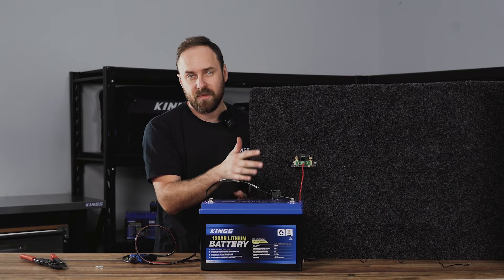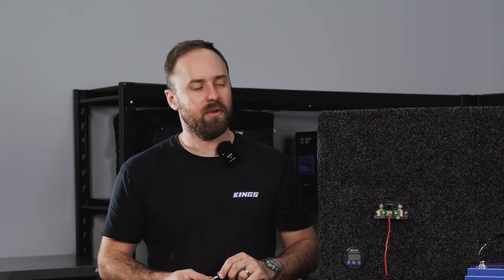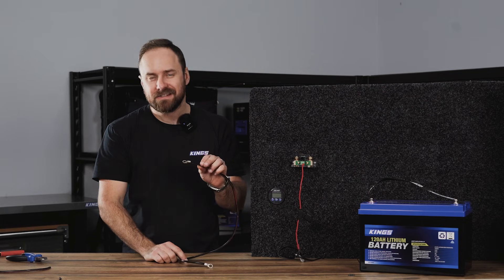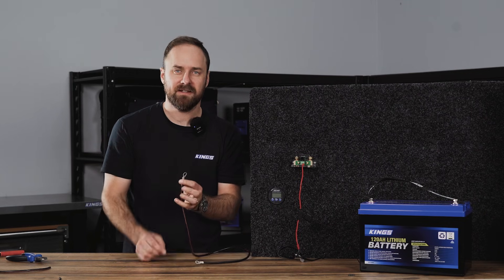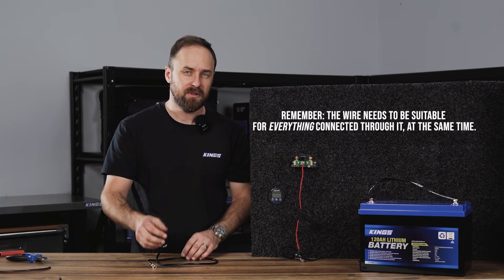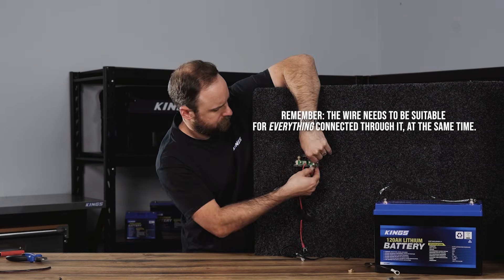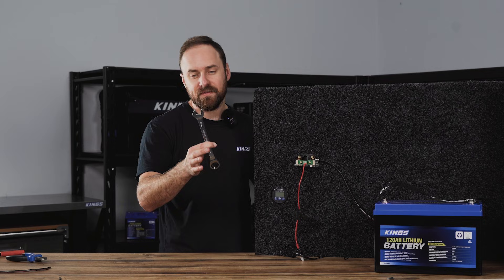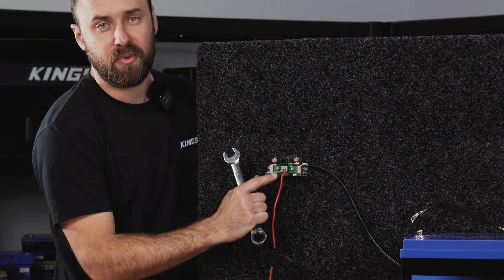I'm now making up the negative wire that runs from the shunt to the battery. You want this as short as possible to minimize voltage drop, but I'm doing it slightly longer here so it's easy to see. The battery terminals in this case are an 8 millimeter bolt, so I've put an M8 ring terminal on this end. It's also important to use wire of a suitable thickness, since all your appliances, devices, chargers, solar panels, and high loads like inverters have to run through the shunt. You'll need a 17 millimeter spanner or socket to tighten the shunt terminals — be careful not to over-tighten and break the circuit board.